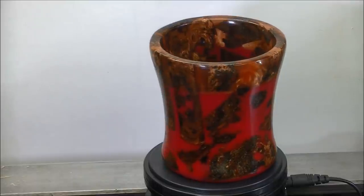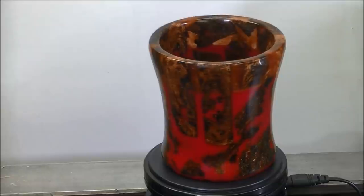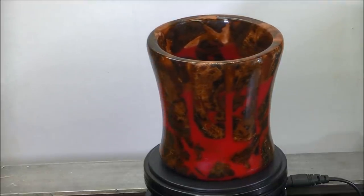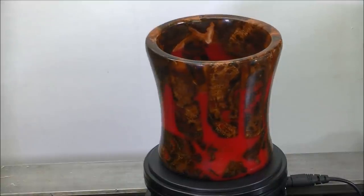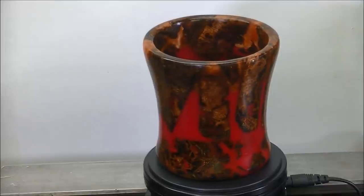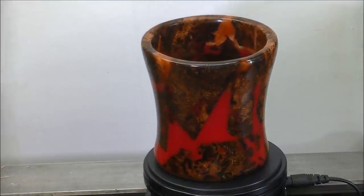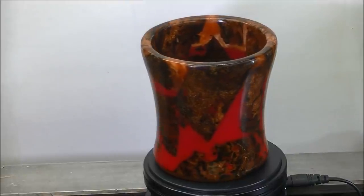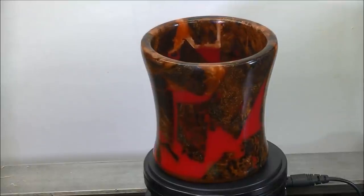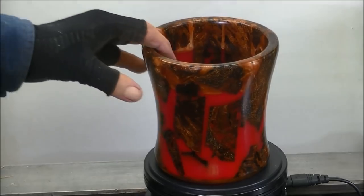Learned a lot. One thing which I take out of this more than anything is I really like the epoxy finish. Once you get it on and once it sits up for a day or so, it sands fairly easy and it polishes like you wouldn't believe. It makes it really durable and for sure food safe. You could fill it with water if you wanted to, you wouldn't have to worry about it. So anyway, I got the bottom all done.